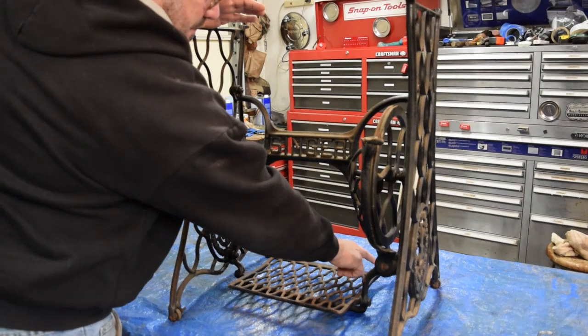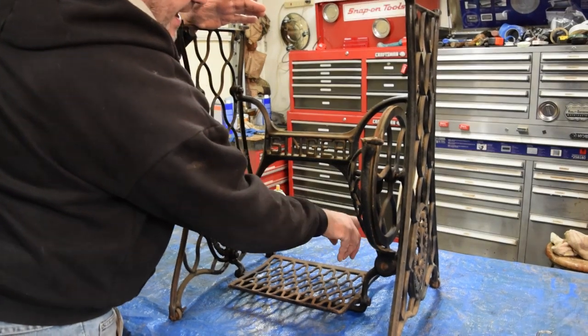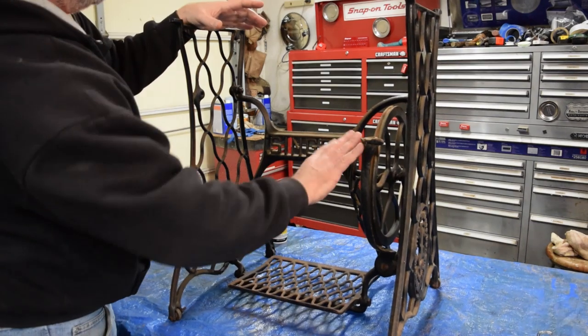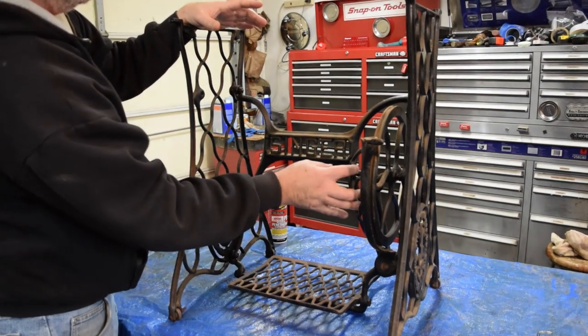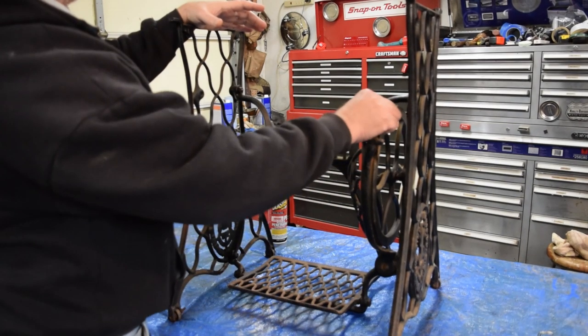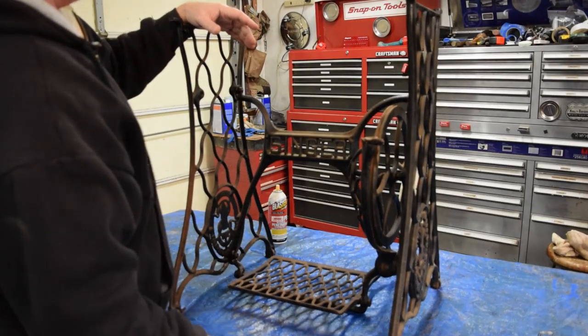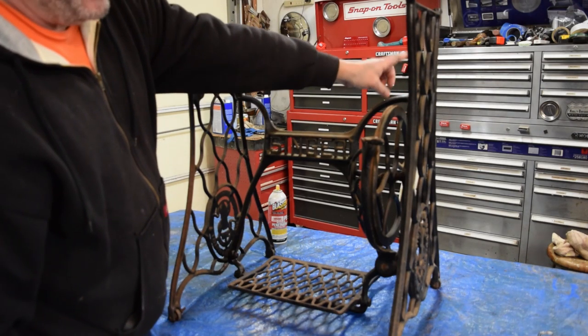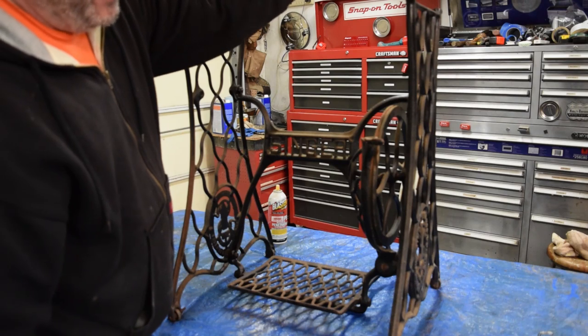The back of the foot plate is attached to the pitman arm, which drives the flywheel. This piece here comes off with a single bolt. This is called the dress guard. This would keep ladies from tangling their long dresses in the flywheel when they worked. There's also another piece here that guides the belt that drives the machine.